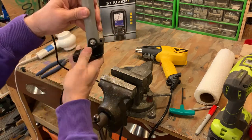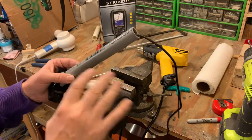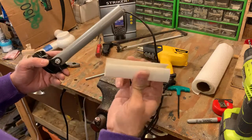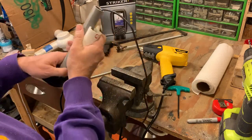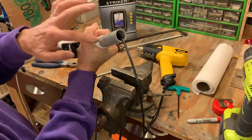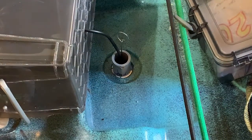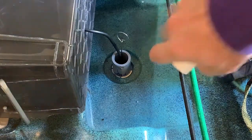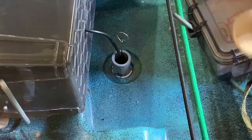The pipe is not quite big enough to fill the scupper hole — the wire raceway in the bottom of the kayak. So I took a piece of sprinkler pipe, I think it's 1.25 inch, cut a slot out of it, and wrapped it around the PVC pipe. When you push it in, it compresses and fills any gaps in the scupper hole so it fits relatively tightly. Here's my actual mounted unit — the pipe comes up through and the spacer is tucked in there as well, fitting quite tightly but not so tight it's difficult to insert.